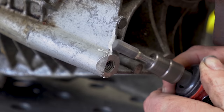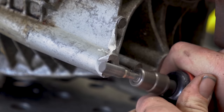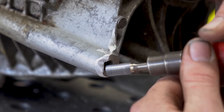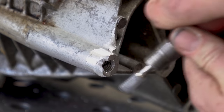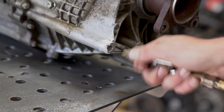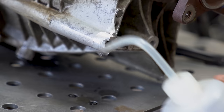To get this down to bright metal, I'm going to use my carbide burr tool and scrape away basically anything that is damaged, including cutting into these threads a little bit. I'm going to be very careful with this. If you press lightly like you should be doing, it won't clog up. It's important that your affected area comes down to bright metal — and not just by hitting it with a wire brush. You actually need to get a layer down in there above the top layer that holds all the oils and junk, because cast aluminum is very porous.